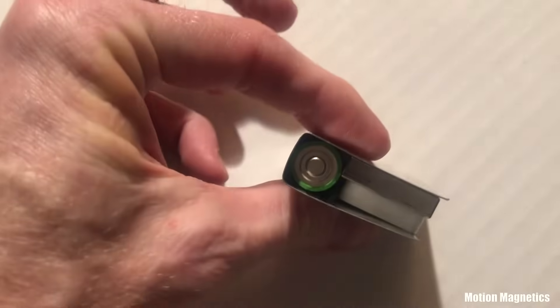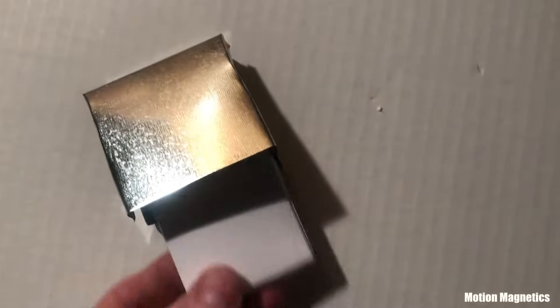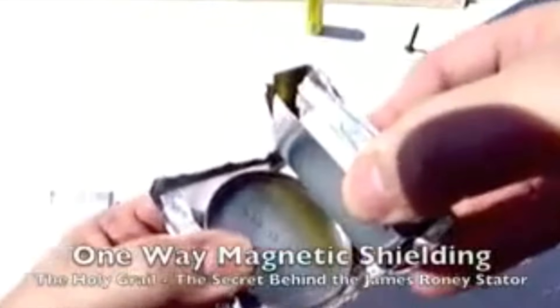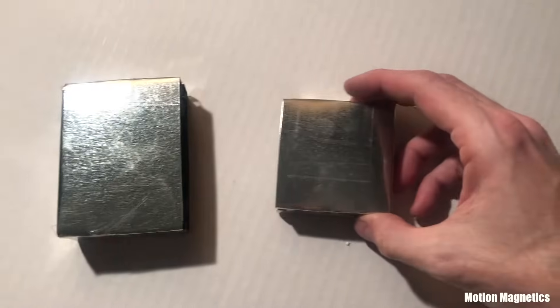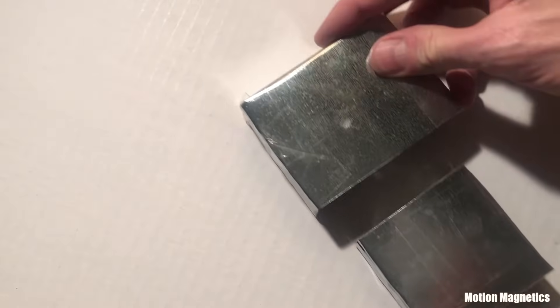For comparison, here is what the first layer of the original James Roney stator looked like. I taped everything together with clear tape so that it would be easier to keep track of each version I did, as well as to more easily demonstrate them for the video. Here is a comparison of the second layer to the second layer of the original Roney stator. These are the exact measurements of the shielding material I cut from the sheets of metal flashing purchased from Home Depot, as well as the size of the spacers I folded from thin cardstock. The three-layered stator is a bit larger than the others but functions very similarly, except that the magnetic field in the front face is a bit more tightly focused.